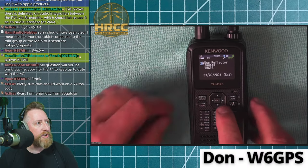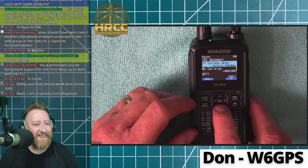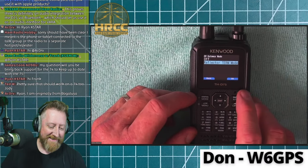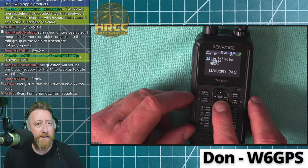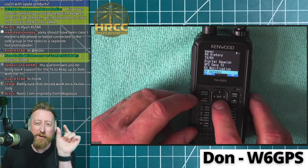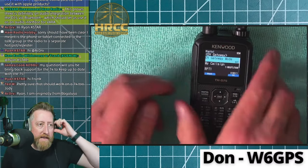Let's change gears here a bit. This is a mode you set when you're in the D-STAR menu within the radio. Make sure, in the upper right hand corner, it says TERM. That lets you know it's bypassing the RF on the radio.